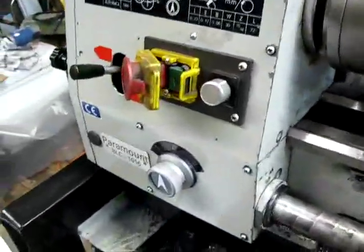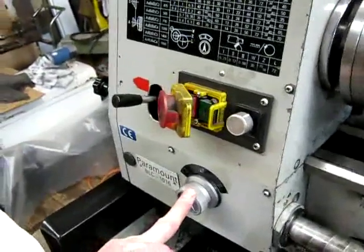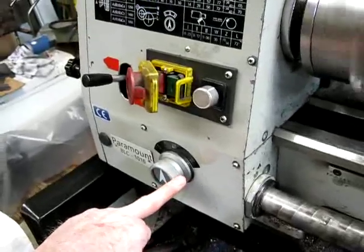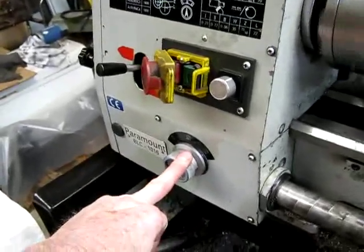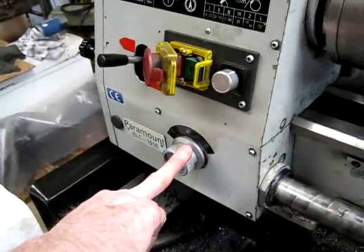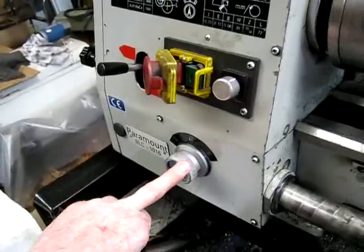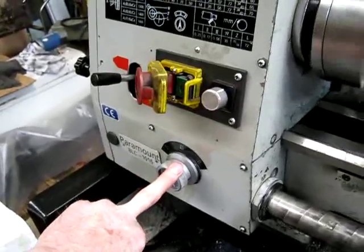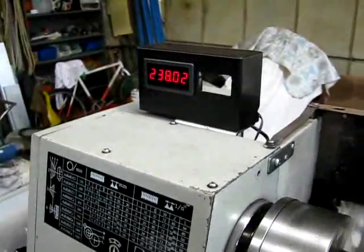Out of interest, I'm fine finishing at the moment — I'm on the finest speed, but I did the original cutting and machining on number 2. That's why I like a quick change gearbox on lathes. I don't really like lathes without them because you're stuck crawling along at one speed, which is awful. You can just switch across quickly and get the job done. It's turning at 238.